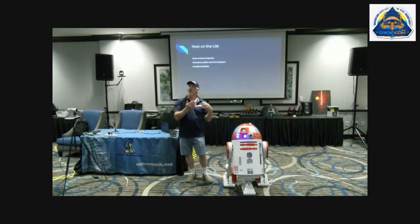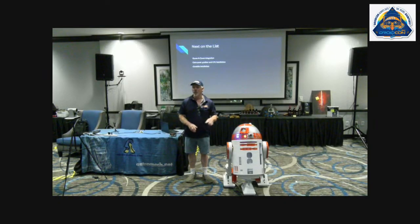The other droid actually will go back a little bit, like Kevin's will, where it can actually look up. I did not do that on this one because anytime you don't have a positive stop on any kind of system like this, slop can enter into the system, so lash in the gears. So it just walks along that, and the foot stays seemingly in the same place, but because the droid is bigger, the foot actually ends up angling. In the shoulder, it's quite literally just a portion of a gear. It looks like a hand like this, and the motor only has to turn this little bit because we're only moving a little, 36 degrees. As a result, it's pretty simple. You don't need any linear actuators. If you want to do it simply and on the cheap, it can be done.